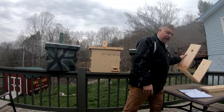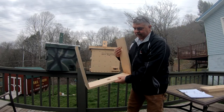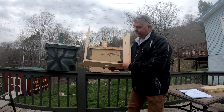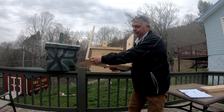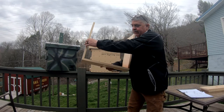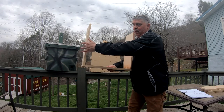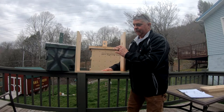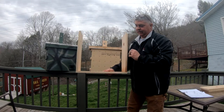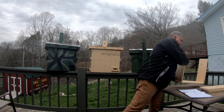You can put this together any way you want, but I use pocket screws and glue. You lay the long one down and put the side pieces on. From this wall to this wall it should be 19 and seven-eighths — that's the dimension.